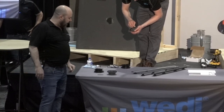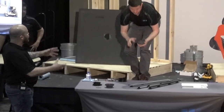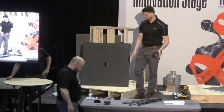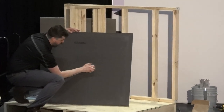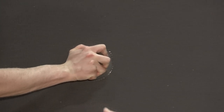Greg is applying a lubricant that comes with our Click and Seal drain to the underside of the drain, which is going to attach to the shower base. Click and seal — all he's going to do is a clockwise motion until you hear an audible click and you're seated. That's the attachment to the Wedi shower base. It does not get simpler than that.